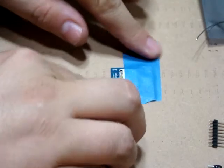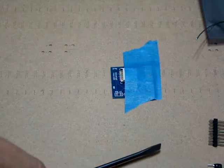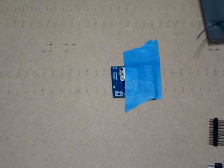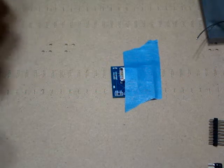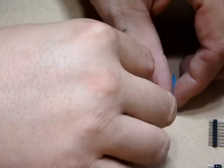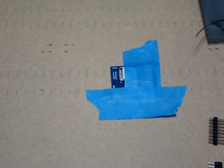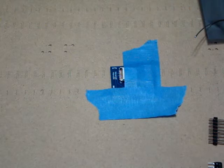Once you've got it lined up, just take a piece of tape — I'm using painters tape here, but black vinyl tape or masking tape works just fine. I'm going to tape the micro SD adapter down and stick the whole board to my desk so it doesn't shift around while you're assembling. Overkill is a great thing sometimes. This board cannot shift around. I've already got my soldering pencil warmed up.